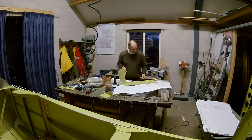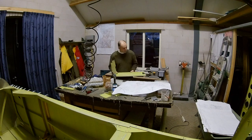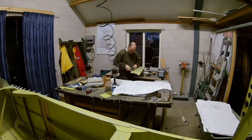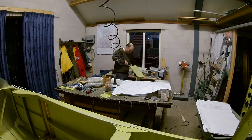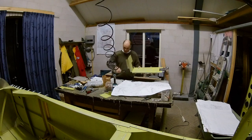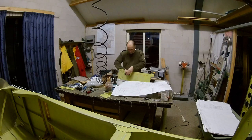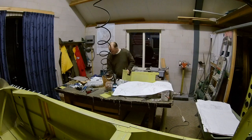The plate nuts are now riveted in — they all need to be flush, so you also need to countersink or dimple all the parts. This is too thin material so you have to dimple anyway. As I said, there are a lot of parts in there. Sounds very simple but it is actually a lot of work.